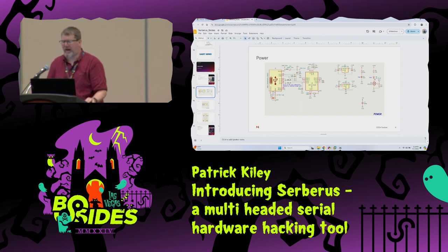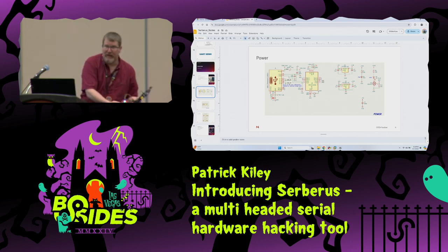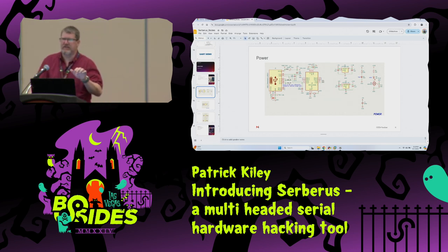So this is how power works. As I can see, it has a little switch on the front. That switch is designed to select the voltage level of your target. You can see that there's a 1.8 volt voltage regulator. That's this guy up here. There's a 3.3 volt regulator. That's the middle position. And then for 5 volts, it actually just uses the USB level, which is approximately 5 volts, but it's basically close enough.